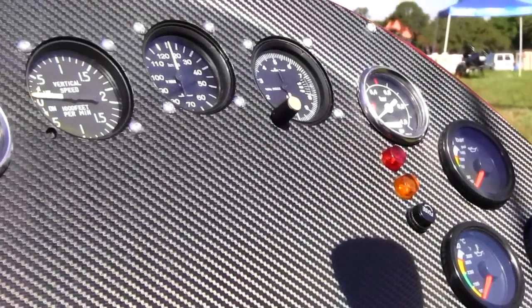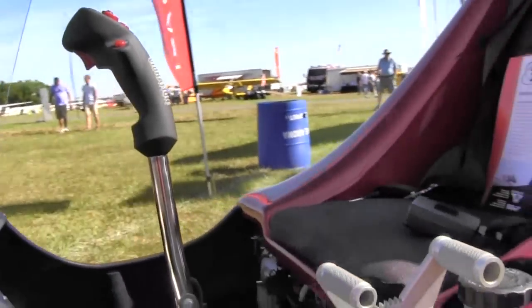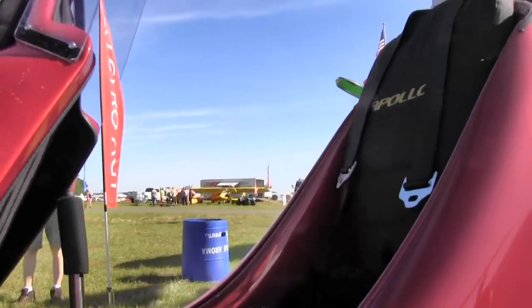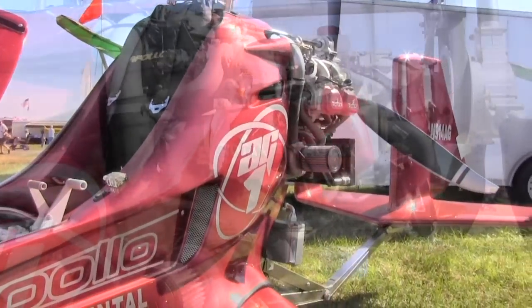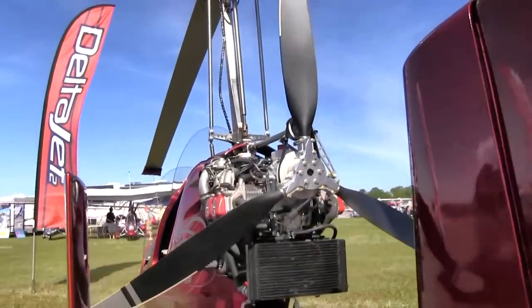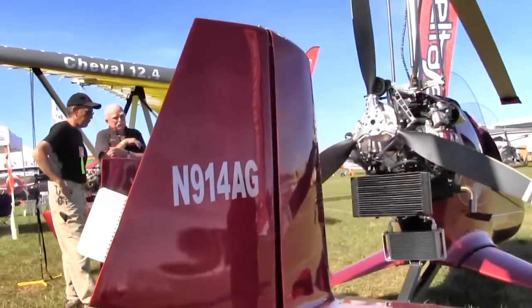Okay. And I would imagine that particular thing would be rather challenging for an individual to learn to do. Yeah, and you're allowed to do that part because that's not building the airplane, that's maintenance sort of. So I have a test pilot who is very experienced in gyroplanes, and he's a commercial helicopter pilot as well, and we have contacts that are helicopter mechanics that have the dynamic balancing system. And because it's a gyroplane, it auto-rotates, so you have to actually fly it to balance it. Unlike a helicopter, which you can rotate. Yeah, sure, right. There wouldn't be any way to... Exactly.